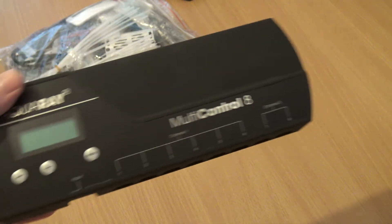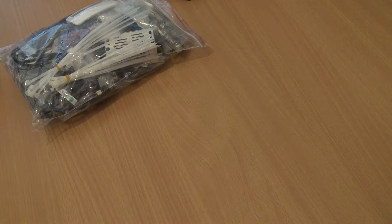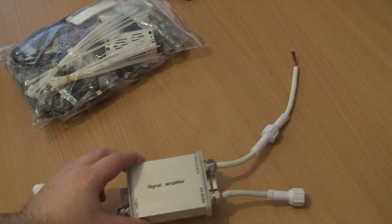I think we can do better than two channels and go for more. Looking at the best way to do this with a Pi, we need some sort of signal amplifier — something that can take the PWM signal from the Raspberry Pi and boost it. The Raspberry Pi has one hardware PWM channel but does have a number of software options, which I'll try before going to the route of buying a separate breakout board with extra hardware PWM.